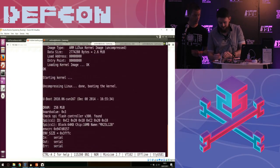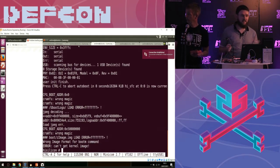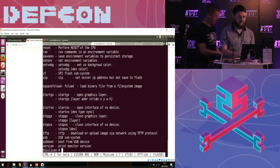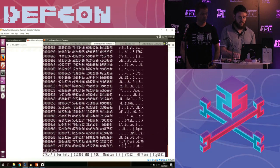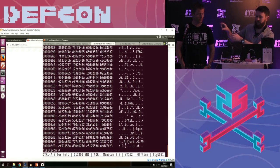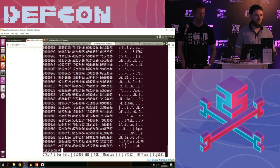You can see instead of getting that 'uncompressing Linux', it now says 'HiSilicon' and a hash prompt. We can type a question mark to get the help, and we get this big long list of commands. Now if we want to dump the memory off the device through U-boot — this is painfully slow, but it nearly always works. MD is memory display, so we do MD zero, that's the base address. We're dumping the memory as ASCII to the screen. A little Python script takes that file and puts it into a binary file. It takes about nine hours for a 16MB chip, but it gives us access to the firmware. Once we've got access to the firmware, we can unpack it, see what the hashed password is, and crack that to get access to the device.